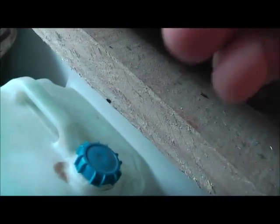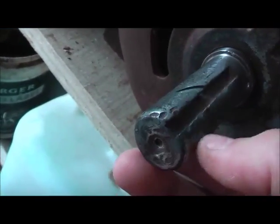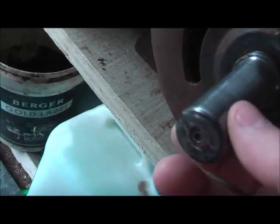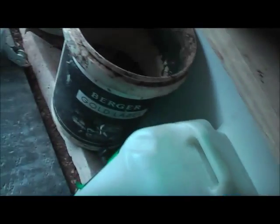Yeah, I reckon the original colour was this grey colour, pretty sure. Bit unfortunate I nicked it with a bloody cutting blade getting the old pulley off, but I had to get that pulley off somehow. I wasn't going to smash it off because I would damage the shaft. I couldn't pull the pulley off because it would have broken the pulley, and I couldn't get the puller to grip on. It's just fit very nicely.